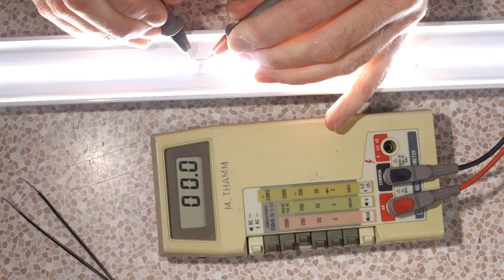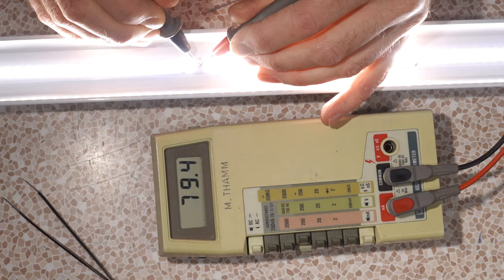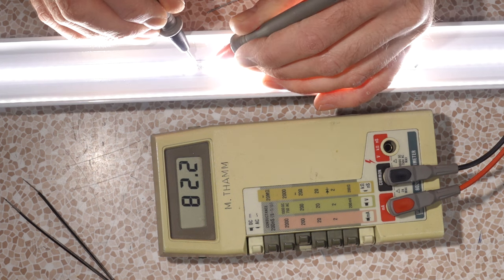The other solution would be to put a resistor in place. So if I could possibly measure the amount of current that this is dissipating across this bridge, 70 milliamps, and stupidly it just keeps going up for whatever reason. Sucks that it keeps slipping. Keeps going up because the diodes keep warming up and consuming more current. It's maybe starting to settle at 83. We're going to assume that it's supposed to be less than that.